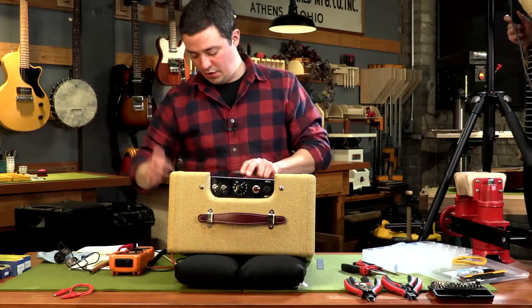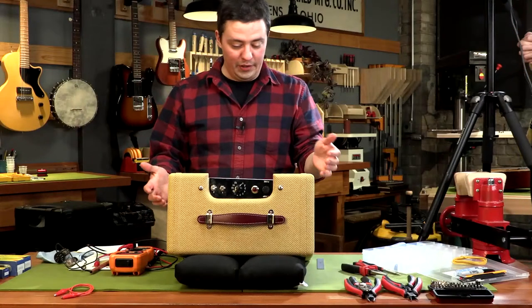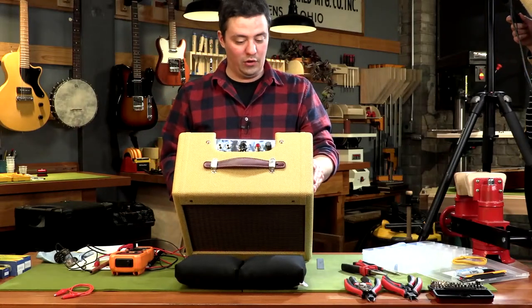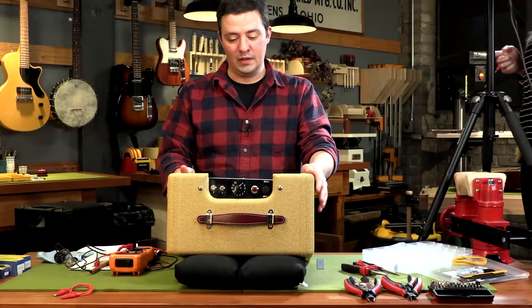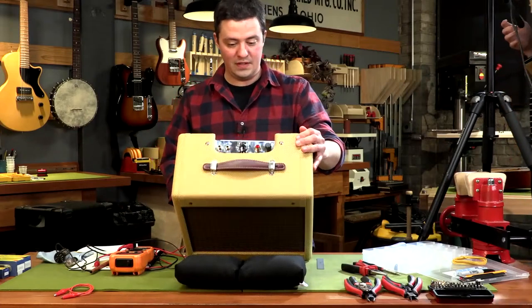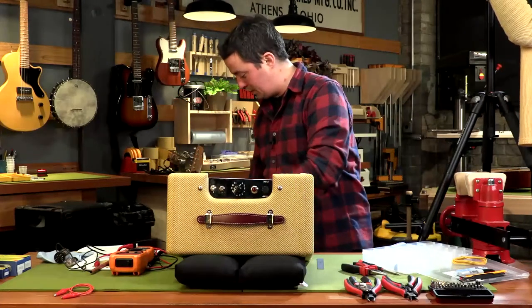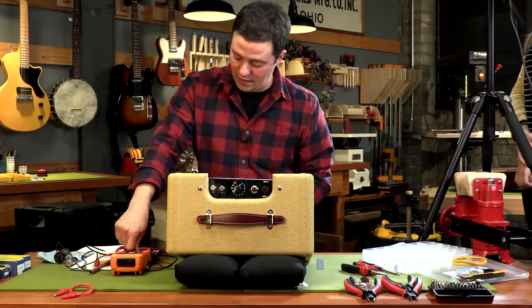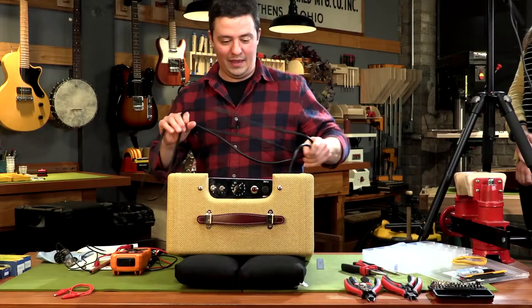A snuffer stick is two resistors wired in series clipped to ground. The resistors stop the voltage from immediately jumping into ground, and it has a non-conductive wooden handle. I place my snuffer stick on that same lead and you can see it just drop like a rock. I'm down to 4 volts — that is safe to work on. Anything below 10 volts DC is considered safe. All these safety tips and directions on how to use the snuffer stick are on page six.